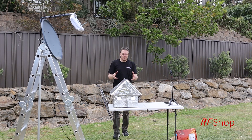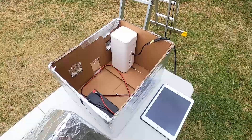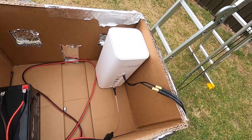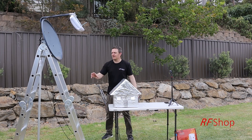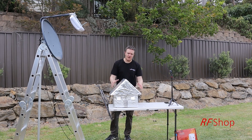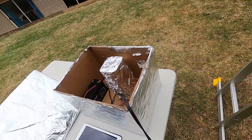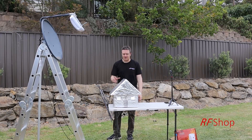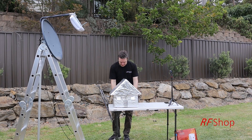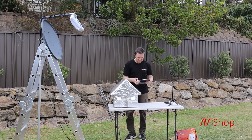What I want to demonstrate here is this antenna working compared to an internal antenna. The setup is the aluminium enclosure, but there are seams and everything so there's still quite a good signal coming in — about minus 90 dBm if I do nothing. So we have a reasonable baseline signal. I had to wrap my modem in aluminium foil so I could simulate a bad signal area and properly compare the internal antenna to my dish concept here.